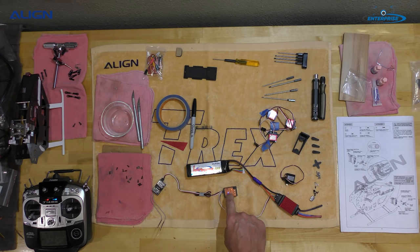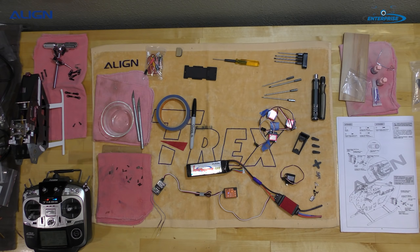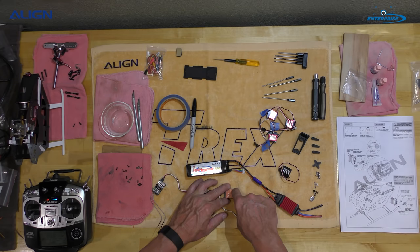frequency to 200. Now we're gonna go into the tail and do the rudder servo center pulse, which is option C. That defaults to blue. It's 1520. The DS455M is gonna run at 1520. I'm gonna press to go to D, which is rudder servo update rate, and it defaults at 50. We want to change that to 333 hertz. And that color is flashing blue. So now it's flashing blue. I'm going to exit out of the settings by just pushing the button.